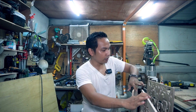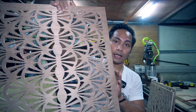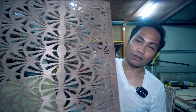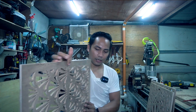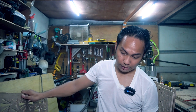The one that I will not use again is, of course, the upcut bit. The back portion is very clean because it's cutting upward, but the top portion — because this one is doing an upcut — has a lot of fuzz, a lot of hair. I don't really like this one. It will require a lot of energy sanding and cleaning.